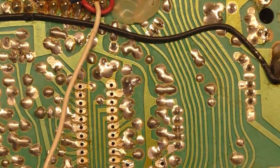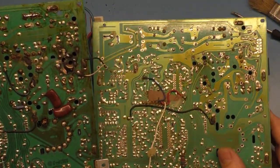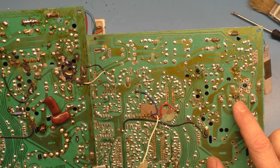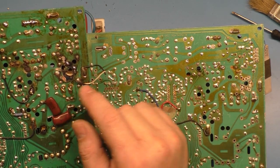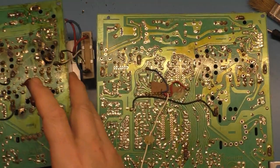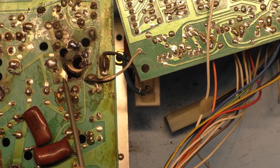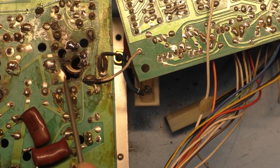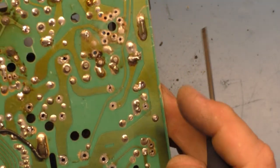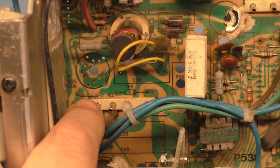Okay, so it looks like C38. Is there a resistor across there? Okay, so that's not supposed to contact. Okay, so that is no connection. So let's look here. If we look at this pad that was missing, it goes over here across from this point to this point right here is a resistor. But on the 19-inch medium res, this resistor is not populated. If we look here, you can see that that same thing, there it's this pad right there. So there's a component that goes across here like this. And it's this jumper. Actually, it's a jumper.